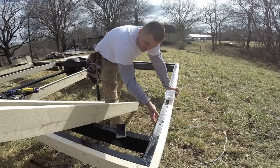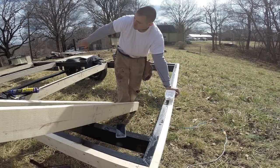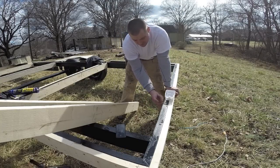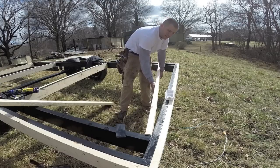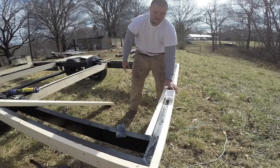Now that I have all the rim board installed and the webbing filled in, I've got to get ready to put my joists in. I'm going to be running my joists front to back. I could attach my hanger to the piece I put on the web, but the metal's sticking out a little bit and I think it could affect it. So I think I'm going to add this on here like that — yeah, I like that.